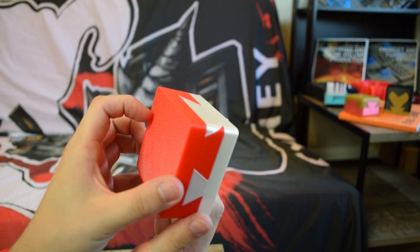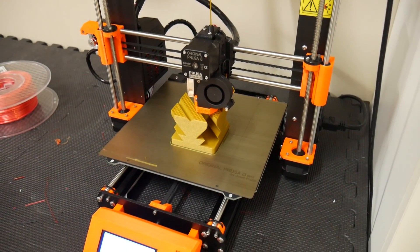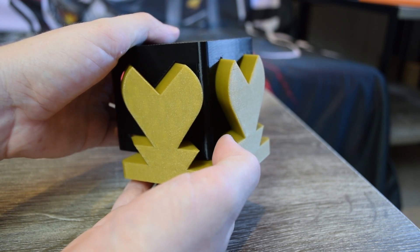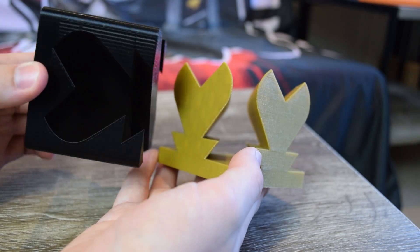I also wanted to explore a shape that wasn't a dovetail, pushing beyond what you can achieve with standard machining. We have much lower geometry constraints with 3D printers, so I designed this more complicated shape. Again it looks joined together, and you might assume it's been dual-color printed in one go — but it hasn't. It uses the same trick as the impossible dovetail, and the parts slide apart like this. You could use this for practical applications — designing something and slotting it together for a dual-color print without a dual-color machine.